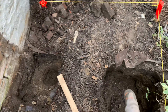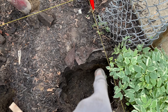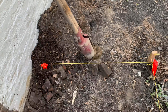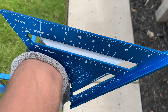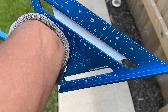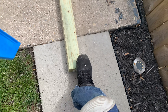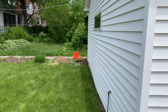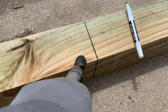This is looking good — might have to make a minor adjustment here. You can see what I've been using is coming in handy. I'm doing it, guys! Considering I bought 4x4x8 posts — two feet go in the ground, six feet of that post will be above ground — are you following me? So why not take an angle square and measure two feet? If you don't have one of these, you need to go out and get one.